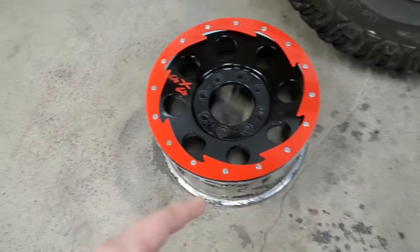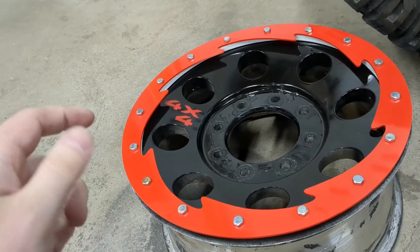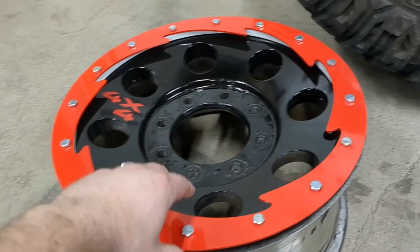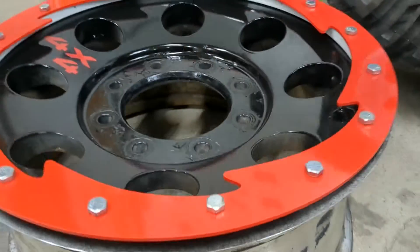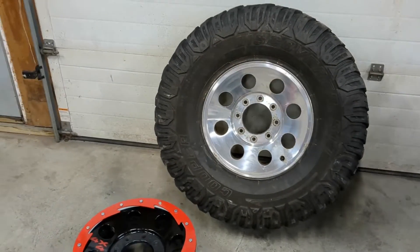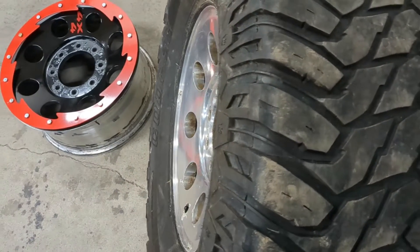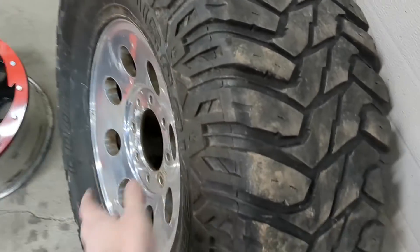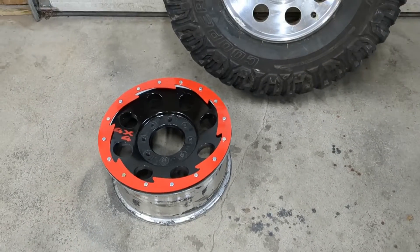This first one is my proof of concept, done with plastic at work, with a half inch ring. The tire bead I measured was 590, so it can be 90 thousandths of a pinch. This will be a quarter inch aluminum plate and this will be a half inch aluminum plate, lasered by my buddy at Empire Metalworks. These I did on the CNC router at work. The idea is to use these for 37s on the Blazer — these Ford wheels are supposedly too narrow for these tires, but they actually don't fit too bad, which is what I was testing by getting this one mounted.